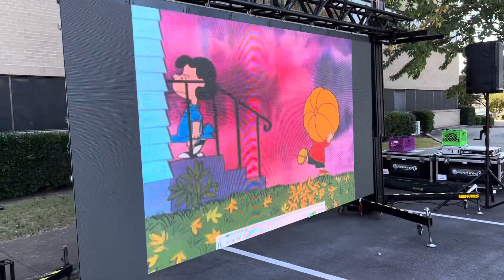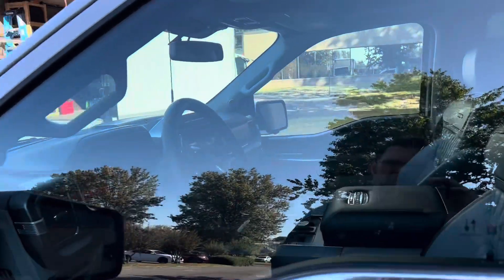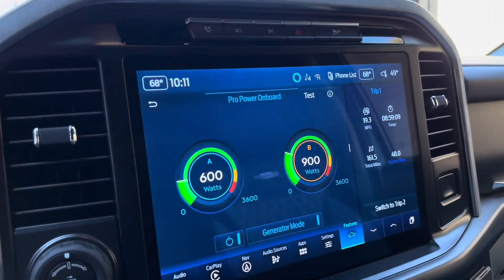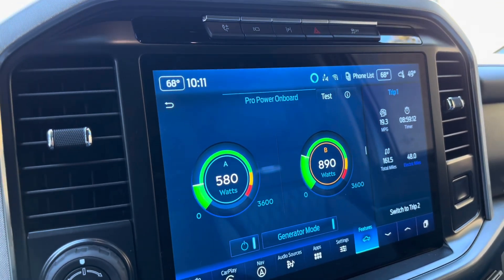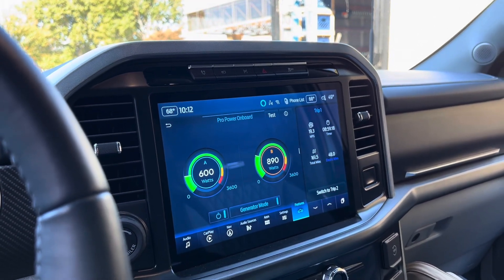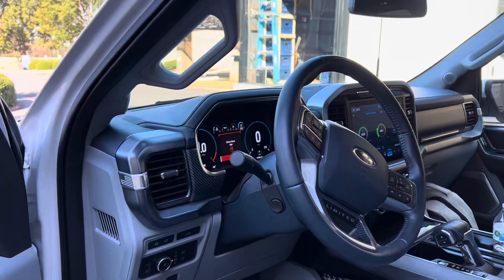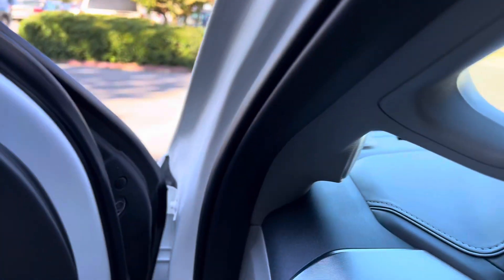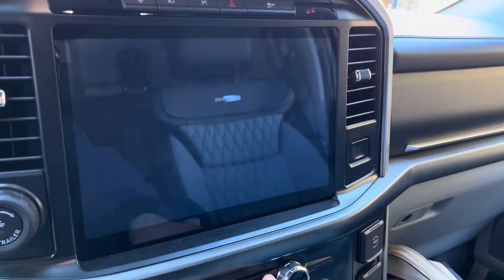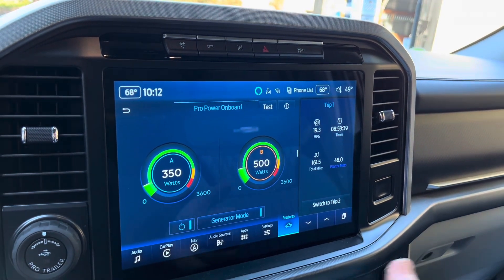On video walls, as the pixels change to different colors, there is a little bit of a power difference. We can see that changing in real time, which is what we'd expect. With this size video wall, we couldn't keep it perfectly balanced because we're using three circuits to power it instead of our typical four, just because of the wall's size. You can also turn off the display on these units by hitting this button, which uses even less power. I like to be able to see the draw.